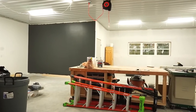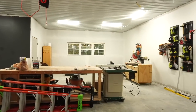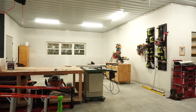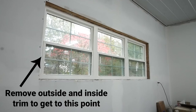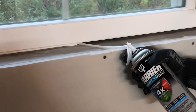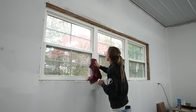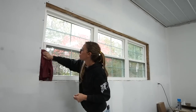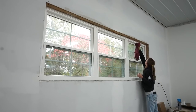I'm installing this trim on new construction windows and doors so there wasn't any existing trim here yet. However, I have done this many times on doors and windows with existing trim. If your window already has trim on it, you simply remove it first. You can use a pry bar and a hammer to carefully remove the trim around your window to get it down to the rough 2x4 window frame. At this point you can check for any gaps between your window and the rough framing, and use some expandable spray foam to fill these in, allow it to dry, and then cut it flush to the window. Before adding any trim, I cleaned my window and removed any residue from the frame.